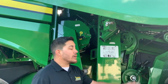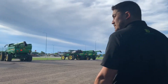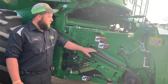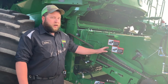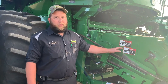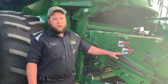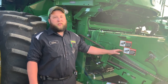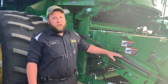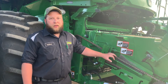After that we'll walk over here around the front and take a look at the feeder house. Another thing I want you guys to be looking at is our chains. Always take a look at your chains as far as your feeder house goes. Our feeder house conveyance chain — we want to make sure that that's tight. If you get a new one put in, make sure you check it about every 25 hours for the first hundred hours as it's going to stretch out quite a bit. Same with your drive chain — just take a look at it, make sure we're not rubbing too hard anywhere. It takes a lot of life out of everything here.